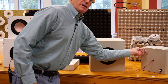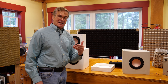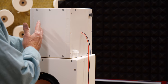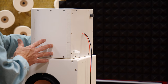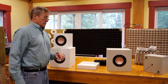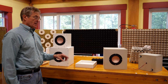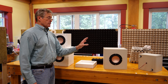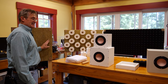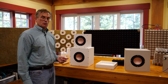We also did videos about a year ago on helium propagation effects on sound. In the back of these enclosures, we have the ability to infuse helium behind the speaker and see what that does to driver performance. The internal volumes on all four speakers are exactly the same, but in the two larger examples, we've placed a layer of Roxul foam board inside to see what the effects of absorbing sound — rather than just bouncing it around inside the enclosure — will have on the output.